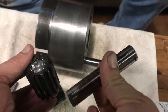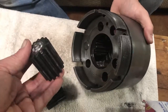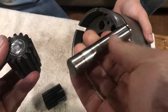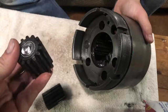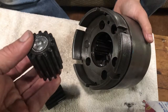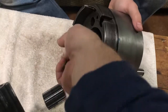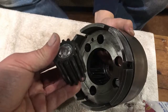You can't fit these long factory shafts in there when you assemble this — there's not enough room. So you have to cut some dummy shafts down. We've tried several different thicknesses of rod, and what we wound up doing is taking some of the old shafts that we replaced with new ones from Federal Marine and cutting those down to make our dummy shafts. This particular dummy shaft we found works best at 2.04 to 2.05 — basically the same length as the long gear. You can see we've already got one gear placed in here and it seems to spin great.